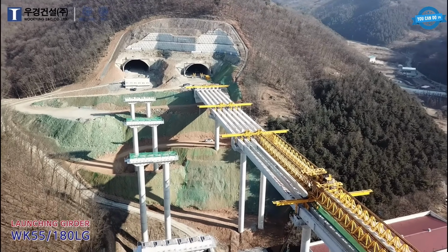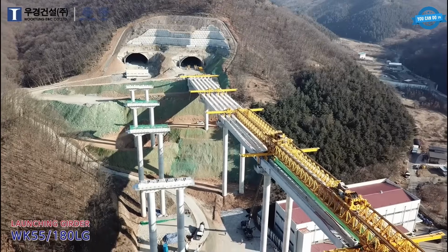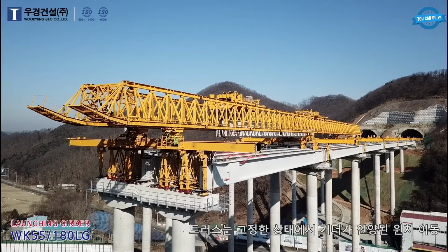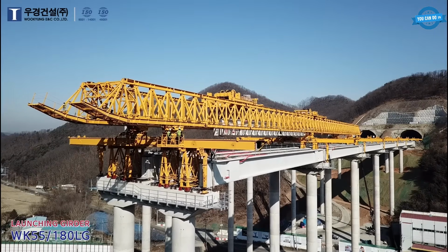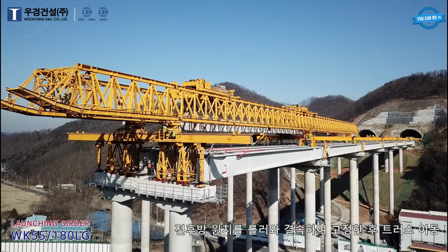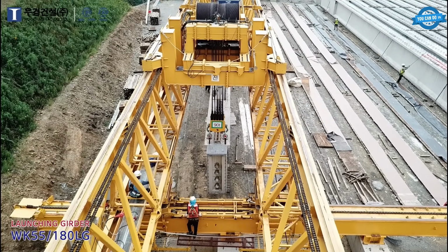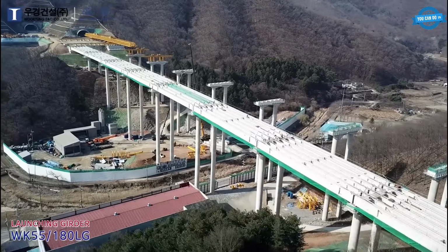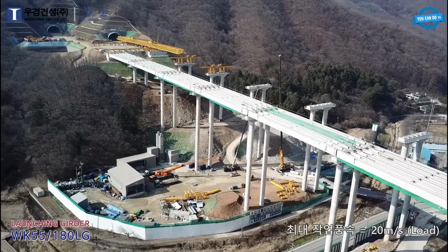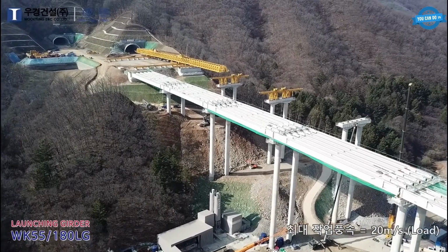Watch a time lapse of one of these machines from above, and you can see the whole pattern in a few seconds. The launching gantry sits over an empty span. The transporter arrives, the gantry lifts, the trolley slides the beam forward, the beam lowers onto bearings. Then the machine walks itself one span forward. A new empty gap appears in front of it. The transporter comes back with the next beam. The pattern repeats span after span, day after day, kilometer after kilometer.